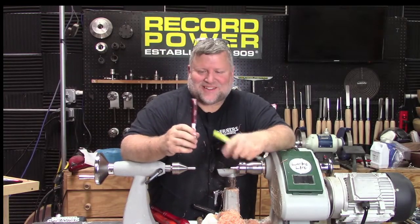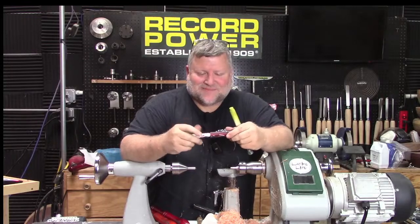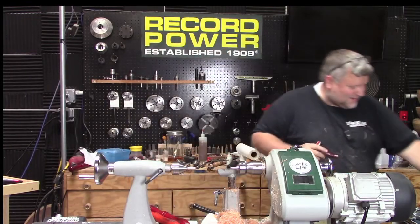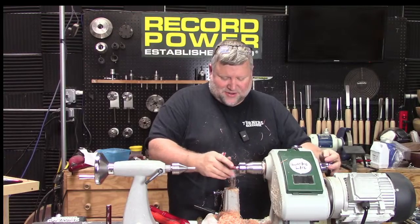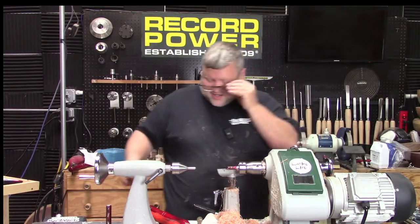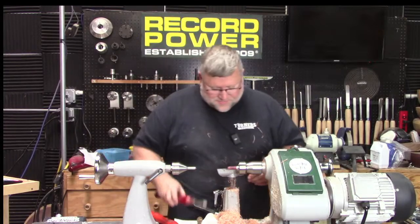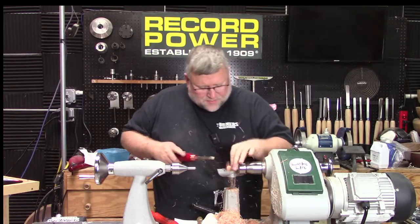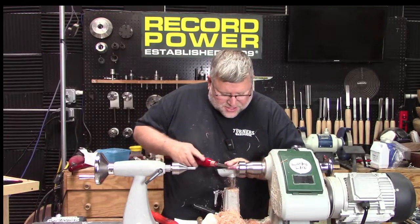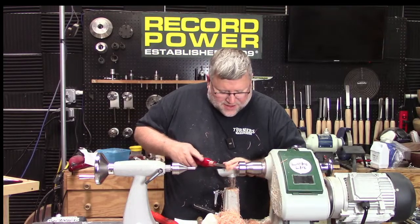Like, I had this at the start of the live stream. The only thing is I don't have a section piece. It's now gone. But, hey, we were getting there. Actually, if I was wanting to, and I probably will just go ahead, I would continue turning this for practice, because now I've got nothing to lose. I can really go at it. But then you can get a good feel of your section size. So I know I need to turn it up here a lot more. And you can turn down your mandrel to the size you need for that section. Now, it may differ from pen to pen, or if you have different styles of pen, but at least you could have a ballpark.